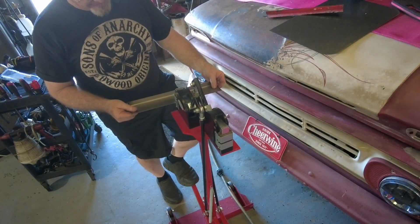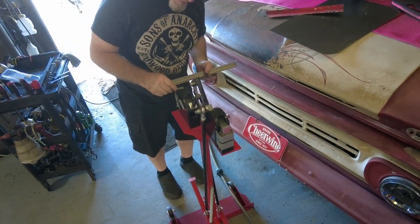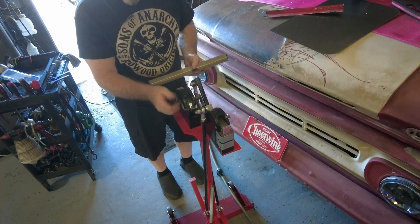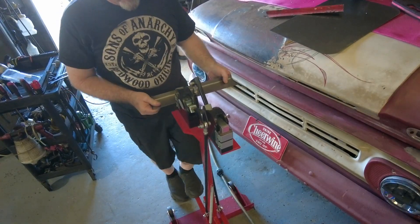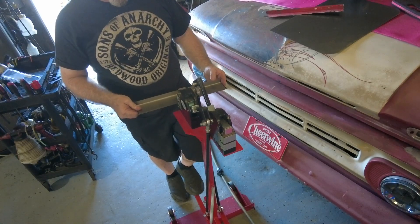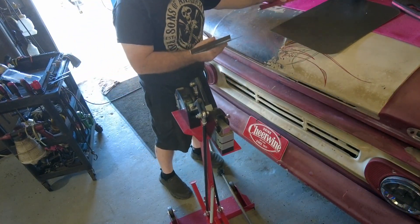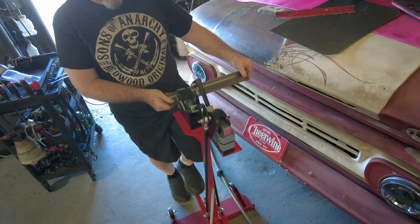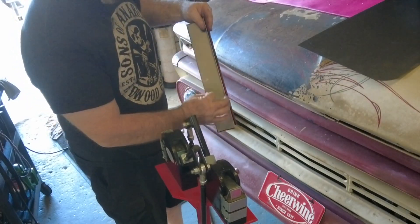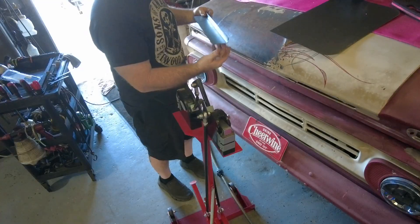It's too much for my tiny little brain. For some reason this always catches at the top - I don't see a stop adjustment screw. I might have to do something so it stops from over-traveling and jamming. I'm going pretty gentle like I did on the other one - I want to try to sneak up on it. It's barely making a difference, I think because this is so deep. I'm not getting the results I'm looking for - I need to get a little more aggressive.